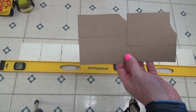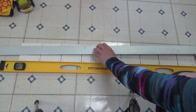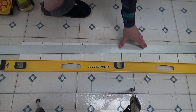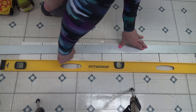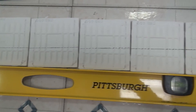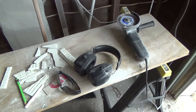This is how I decided to template the bottom edge of the insides — the inside has a slope of a quarter inch per foot. I didn't want to make individual templates for each piece, so I counted out all the tiles I'd need, lined them all up, measured how tall it needed to be on one side and how short on the other, attached a ruler, and drew the line. It worked out great and was so much faster than doing them individually.